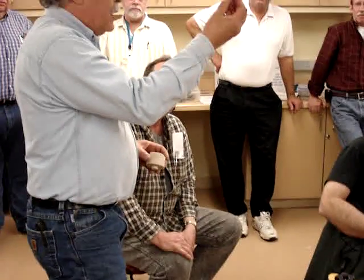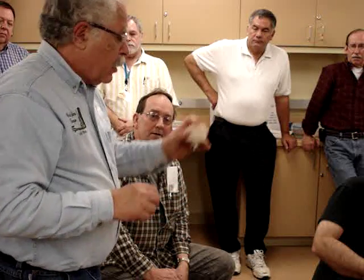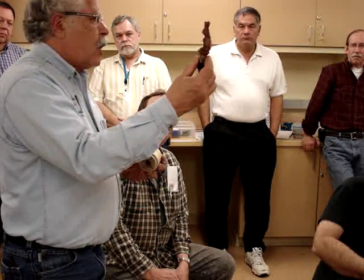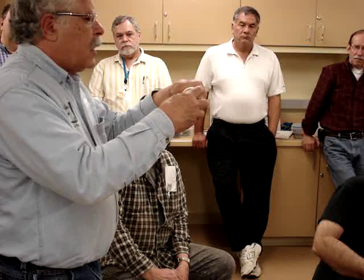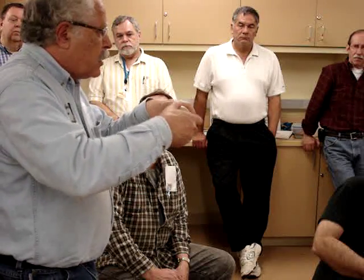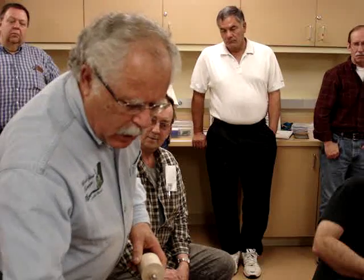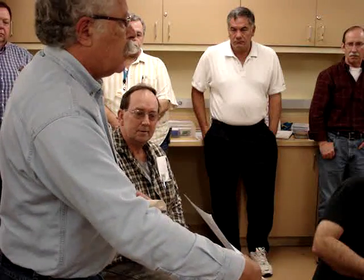It costs 25 cents — buy a 3/8 inch, inch-and-a-half bolt at Lowe's or Home Depot, put it in a piece of wood, and you get a bottle stopper jig. One of the nice things about this is I do a lot of multi-axis turning. Students don't necessarily have number one jaws to hold a small piece of wood, but you can use this to do multi-axis by putting it on the number two jaws, then tip it and do your axis — rotate it, tip it, rotate it — and put in the multi-axis. Instructions are on my website if you're interested.